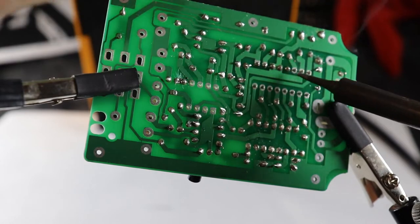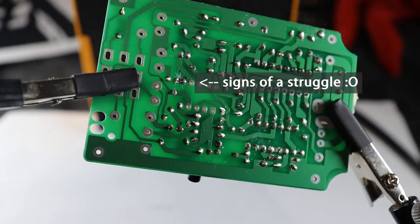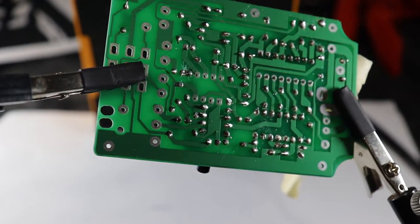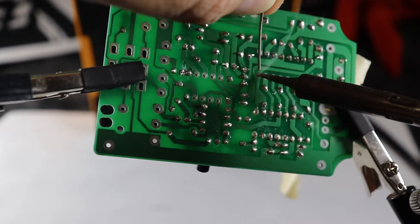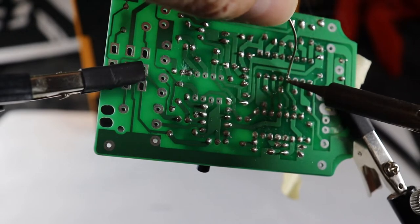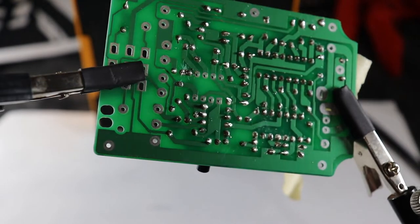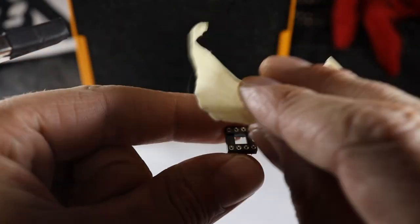So to explain what the IC chips are a little bit better, the smaller one is what's known as an op amp, and it does what the name implies, it amplifies an audio source. And the other one is the digital delay processing unit, and it's harder for me to explain exactly how that one works, but that is where most of the functionality of our delay pedal is happening. So you can think of the IC chips just as a block function inside of a box, and then you just hook up the proper inputs and outputs to it to make it work.